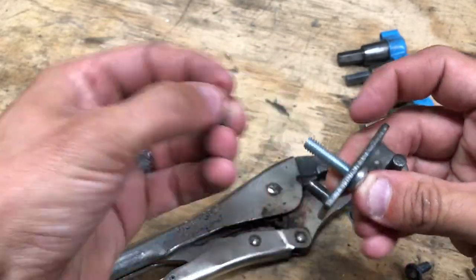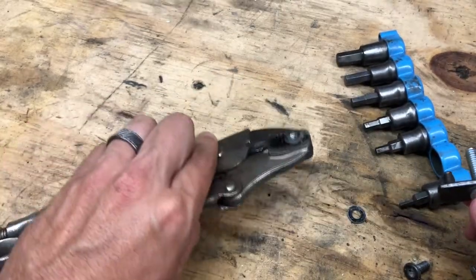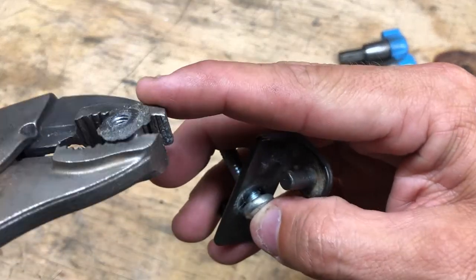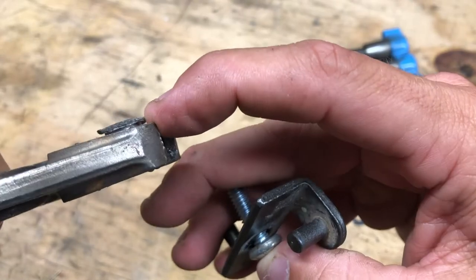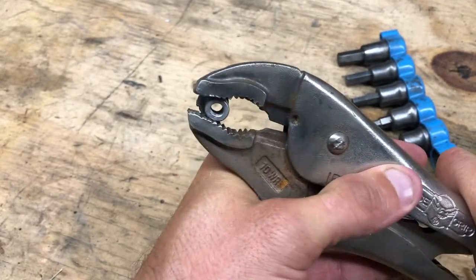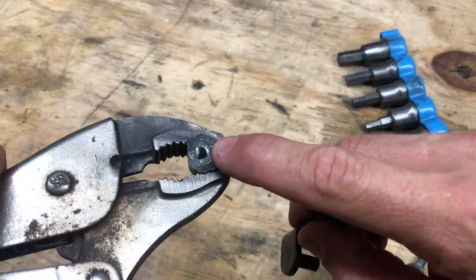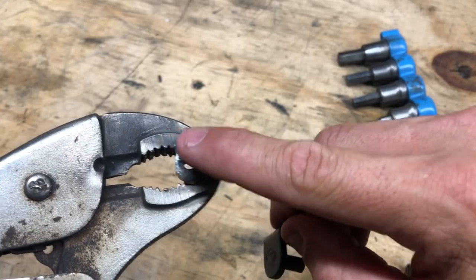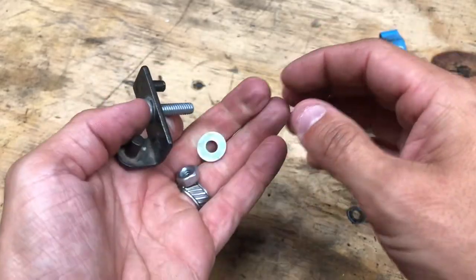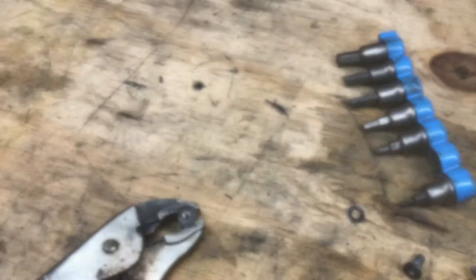So literally all I'm doing is drilling a hole where this anchor nut once was that we just took out here. It basically just tore out of the sheet metal. You can see that this was all that was supporting it, this little bit of sheet metal. These anchor nuts basically sit in a void inside the furniture, and that's all that you have when it comes to the rigidity of it. So let's go ahead and drill a hole straight through the frame. We're gonna have a nut on the outside. We can paint it if we want, but not a deal breaker.